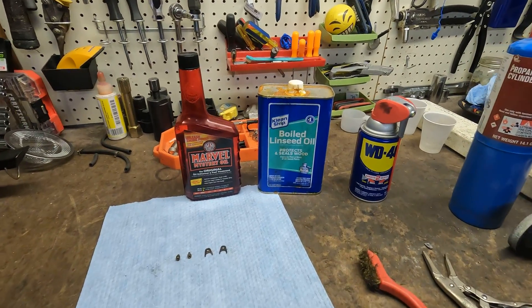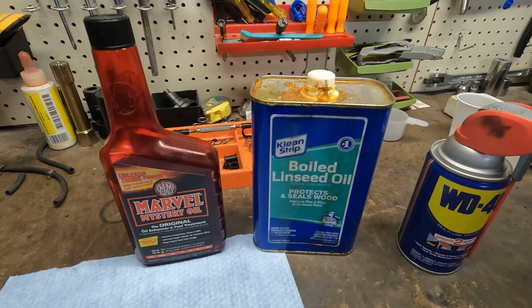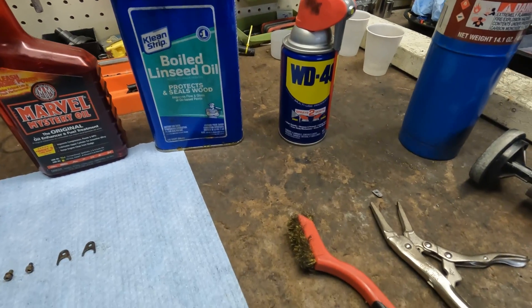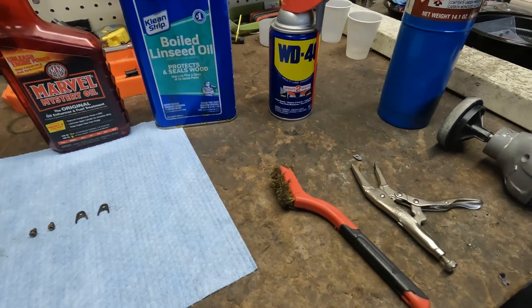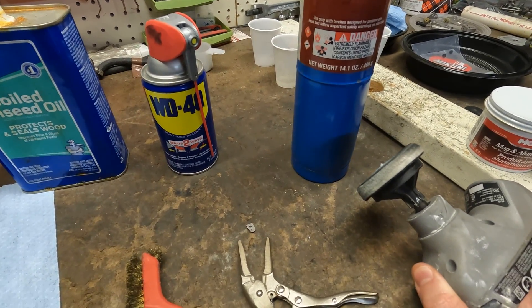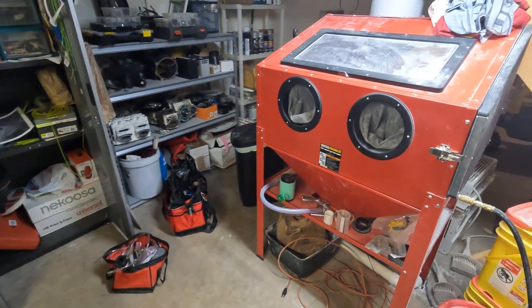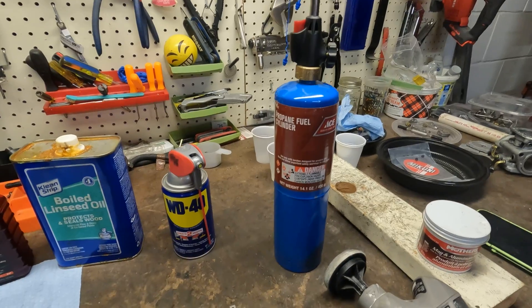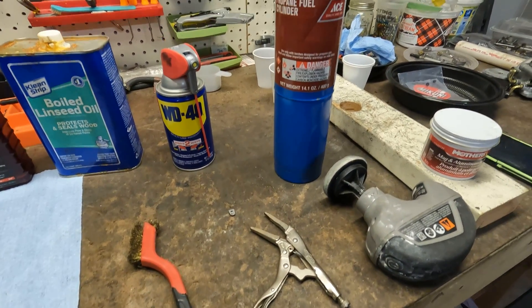Let's talk about the tools and materials needed for today. You're going to need some type of oil that's going to help coat the metal — this is going to provide the protection after it gets heated. You're going to need some type of tool or implement to get rid of the rust. You can work at it with a brass brush, you can have some type of abrasive or buffing wheel, or if you have the means, you can soda blast the rust off. Lastly, you're going to need a blow torch to heat up the metal and some vice grips to hold that piece of metal over the flame so that you don't get burnt.